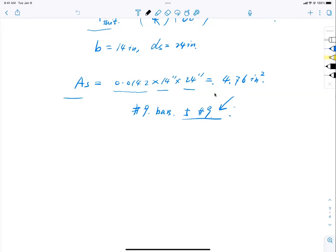And that is based on the relationship between the deflection and the height of the section, which is inversely proportional by the power of three. There you go, right? So that's how we determine the height.